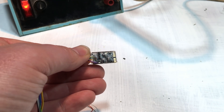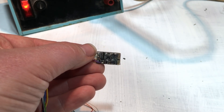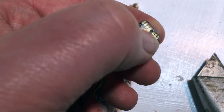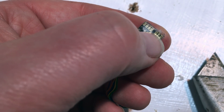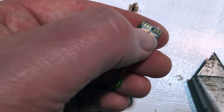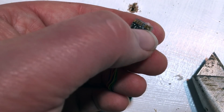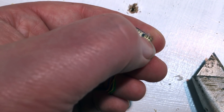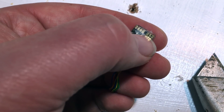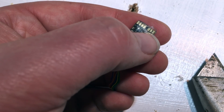It's not something that's going to be easy to film and solder at the same time. What I've done first is remove the heat shielding over the three tabs we're going to need to solder to — it's okay to just remove it in that small area, leave it intact on the rest of the chip. Just use a very sharp craft knife, don't cut too deeply; you don't want to sever any of the copper tracks. It's quite easy to do — just peel the unwanted piece off and that exposes those tabs ready for tinning.